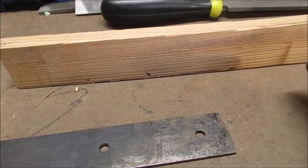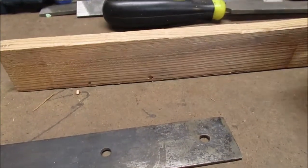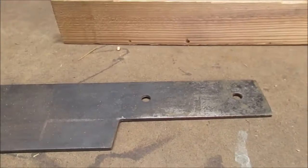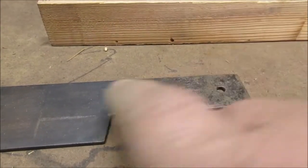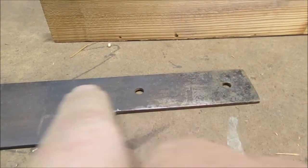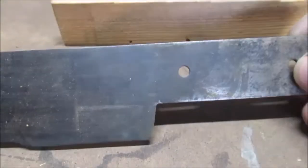You're gonna see a few lines up and down where the saw had to pause because it got hard to push - that's where you get the wavy lines because it's really hard to saw through this. I used a Lennox heavy-duty blade and it got hot. We're off to cut this out, then we'll figure out drilling another hole. We're gonna get this cut out with the grinder's cutoff disc so we can start doing our measuring.